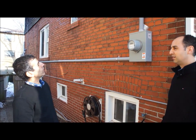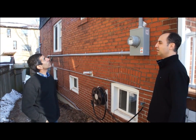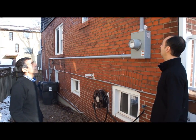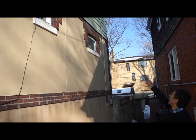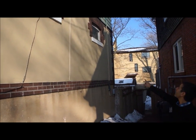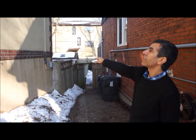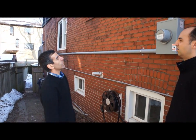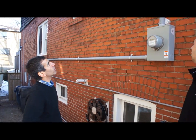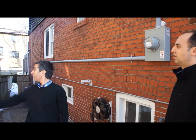Starting off with this — this is the service panel. Yes, this is a meter. This is a 200 amp meter. We just installed it for Andrean. And as you can see, the size of the conduit is 2 inch PVC. I want to show you what the existing service was. The existing service for this size used to be like this — that's what 100 amp looked like. And as you can see, there's no meter outside for this house. The meter used to be inside the basement.